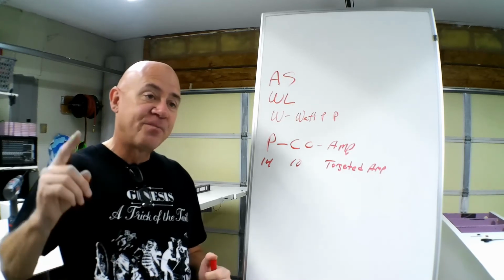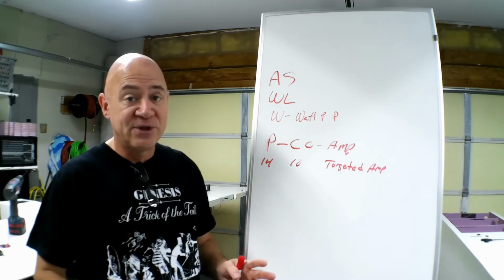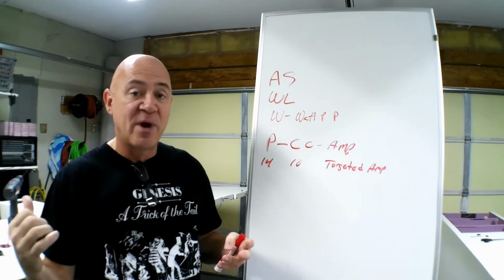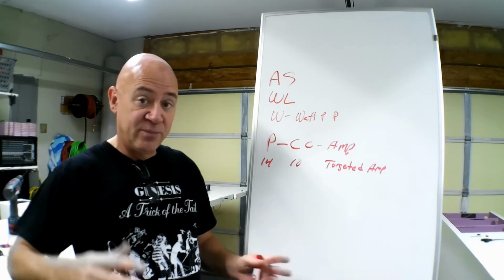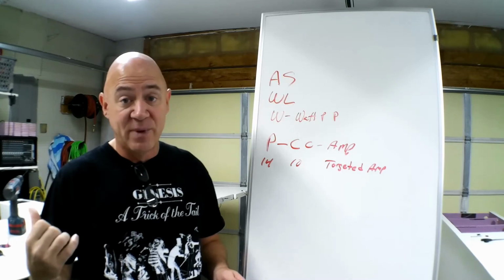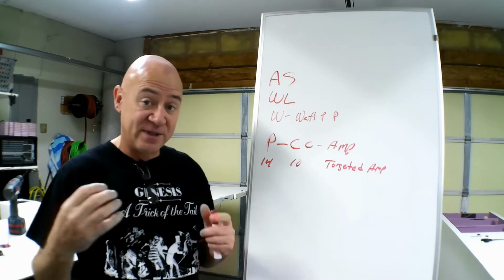Another thing to think about, though, is how many blades do you need? And this confuses people all the time. The reason large warbirds had multi-blade propellers is because they needed enough prop to grab enough air for the horsepower that was in that big radial or that big V12. Okay? So instead of making the landing gear longer and putting a bigger diameter prop on there, they added blades. So the only reason they added blades was to be able to grab more air with the available horsepower, and they didn't want to lengthen the landing gear. That's the reason you see some planes with 3, 4, 5 blade props, because they've got to grab whatever air they can with the horsepower that's available.